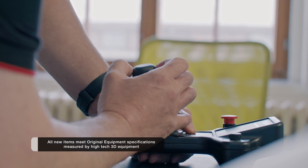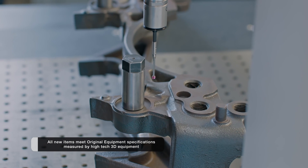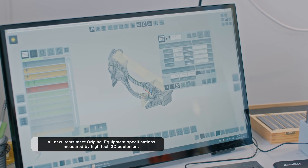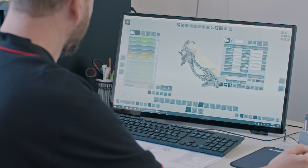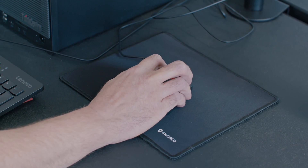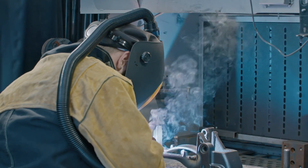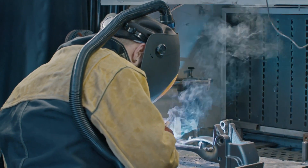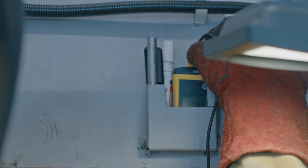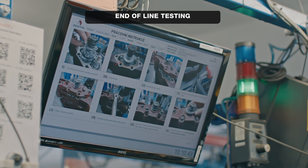We measure samples on a very precise coordinate measuring machine. This 3D measurement machine provides detailed feedback on supplier samples and serial production parts. 3D measurement supports the steps defined in our control plans. On a daily basis, we verify results of our rework activities — for example, pad carrier welding and machining. Hardness measurement confirms the specified hardness level of heat-affected zones in welded parts. Any doubts in results lead to re-evaluation of the entire batch produced.